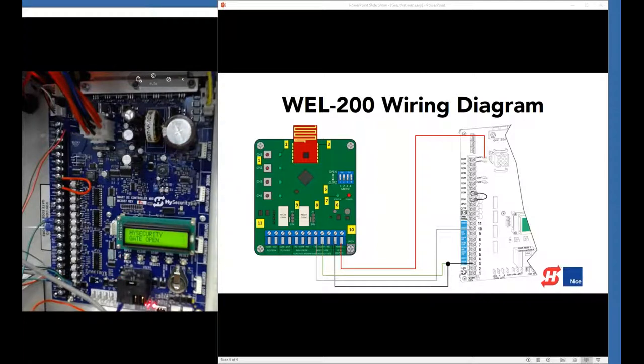Next question: Do I really need to connect all of these devices and edges? No — you only need one safety entrapment protection device that's monitored to make the gate functional. That's what you need to make the gate operator work. It may or may not be sufficient to make the gate itself safe, so install what you need to protect from entrapment, but operationally, one sensor is all you need.